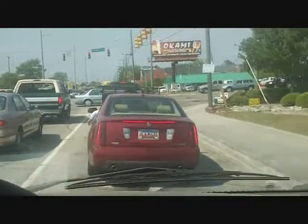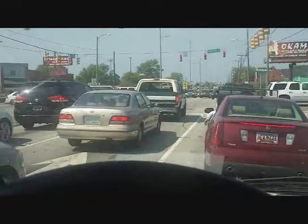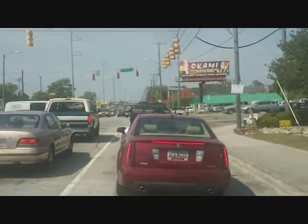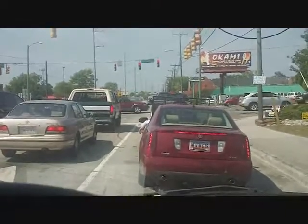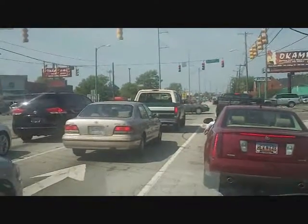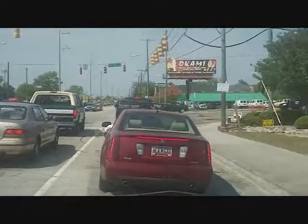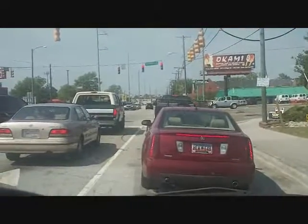Back in traffic again on College Road, about the same place I was the other day, except it's only 3 o'clock. It's pretty warm — about ready for the floodgates to open. We got a new breaker in that unit and everything ran fine. Just a bad breaker and bad capacitor at the same time. I'm glad I turned the breaker off to take my high side hose off or I would never have known. I have a feeling the summer service floodgates are about to open here.